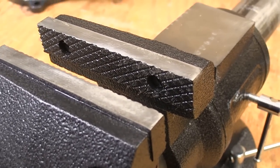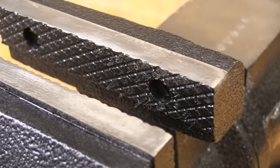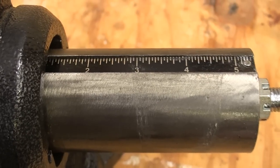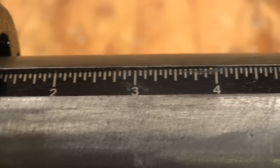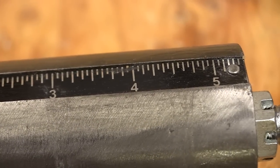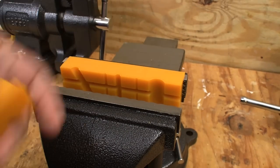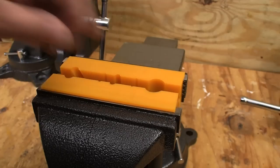For more traditional work, the other jaws feature a 5 inch wide insert with 3 inch throat depth and a 5 inch clamping capacity. The movable jaw is supported by a massive round arm, and it even features a scale that lets you preset the jaw opening. For more delicate work pieces, you can add these non-marring jaw inserts — magnets hold them in place so setup is virtually instant.